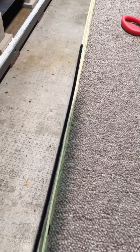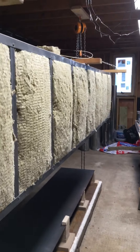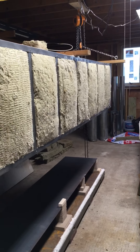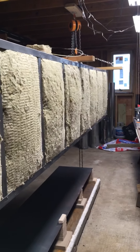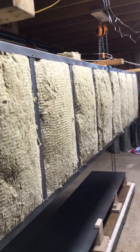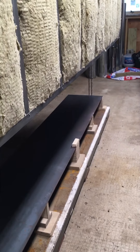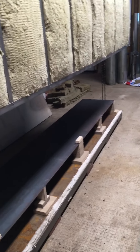We brought the middle of the oven up to about 900 degrees and it took us like two hours to get there. Then we held 900 for half an hour, then we pulled out a burner and a vent, capped it, and it cooled very slowly. The next morning we opened the oven up and it was 200 in there, so it held its temperature well.